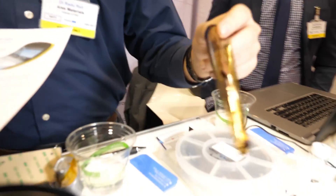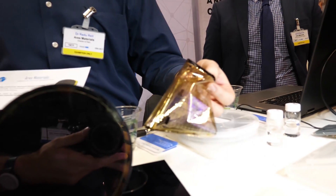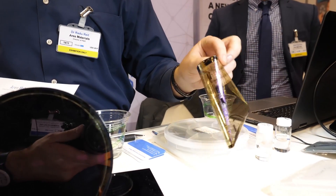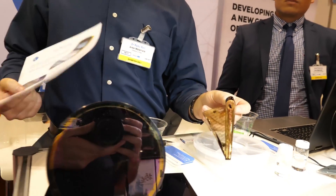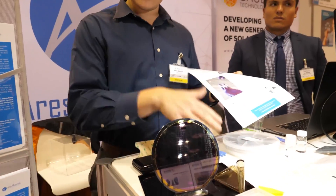Currently the industry — Samsung, LG and all these guys — they're making these transistors, these displays. To make them flexible, they make them on polyimide. This is a pretty old material from the 1950s and it's got a lot of disadvantages. This one specifically is very high stress, so it curls up into a little tight circle like this. With our materials, we eliminate that curl.